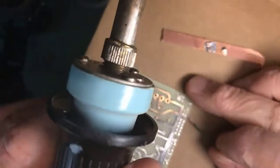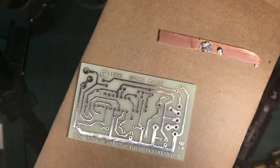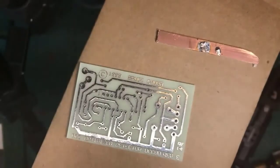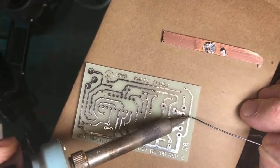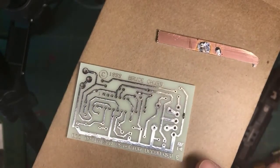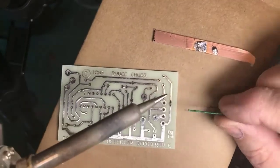Let's go back here, Ken. Yeah. So what you're talking about is you want to tack on here. Right. Again, wire cutters. One moment. Let me prepare for a demonstration of how to do this. With, again, tinning is going to help you. The little thing you want to go on to, okay, I've put a tiny amount of solder there. I have a tinned wire.